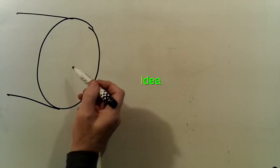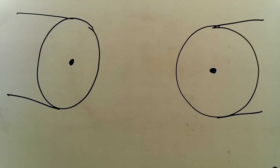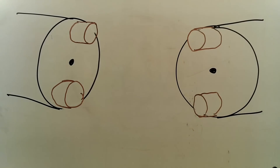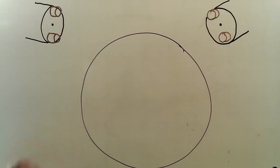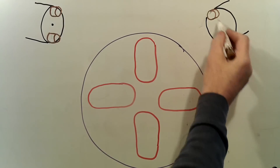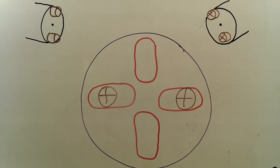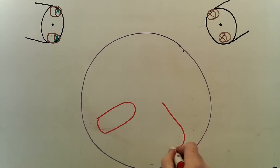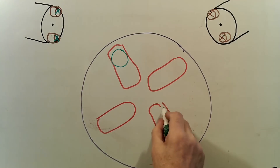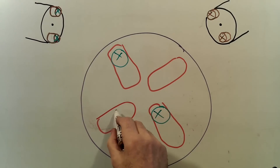At first I did think about using the Hardy-Spicer system mounted on the end of a Morse 4 taper so that the flexible section remained inside the jaws. But if the Morse taper ever gave way under load, I would lose the precision of my dead centre inside the main spindle tube. Then I hit on the idea of replacing the two keys with ground rollers — after all, it would make them replaceable. And the free-floating disk to have four short captive slots in it — after all, it too would be replaceable.